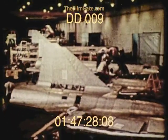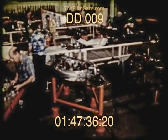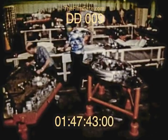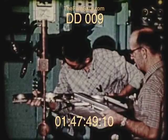This is the D-21 final assembly line. Far to the rear of the building, the mating facilities can be seen, while in an adjacent area is a detail assembly where smaller titanium parts take shape into bulkheads and frames. Details are pre-assembled with clamps in order to facilitate the spot welding process.